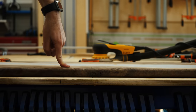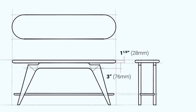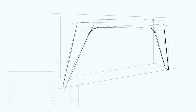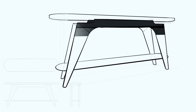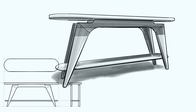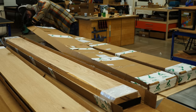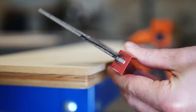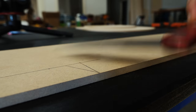The top still has a bit of bow, but here's why I'm not concerned. The design I landed on has the overall thickness of the top at a little over an inch, while the thickest and strongest part of the piece is the stretcher, which is about three inches wide. The amount of force needed to bend that is a lot — and the top could be flattened with one finger's worth of pressure — so the stretcher is basically going to act like a giant clamp to pull and hold the top flat once assembled. For lumber, my total costs came out to $168.22, and this was my first time ordering online from Woodworkers Source — and I can confirm yes, you can order lumber online.